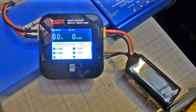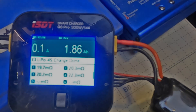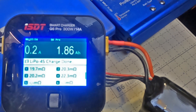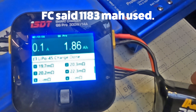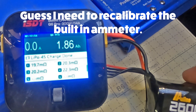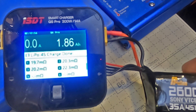After the flight I plugged it in and it bounced back to 14 volts and 3.5 volts on all cells. Charged it back up and it took 1.86 amp-hours. Internal resistance is now around 20 milliohms — ranging from 19.7 to 22.3. Not bad at all. If you're going to fly it gently without damaging the pack, you'd get 15 minutes or more out of it.